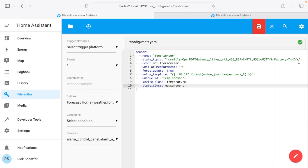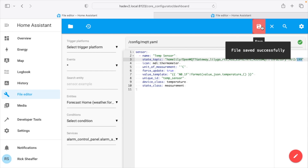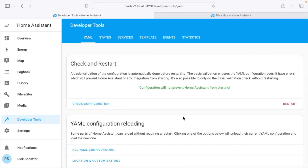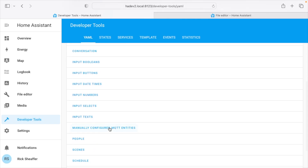This is a tricky thing — you might encounter other brands of temp sensors, because we're not only reading our sensor, we're reading any temp sensor this antenna picks up on the LilyGo device. This could be your neighbor's temp sensors, and it'll also pick up moisture sensors, security systems, and all sorts of things. I'm going to leave this at 199 and can change it later if the batteries die. I'll hit Save, go back to Developer Tools, and hit Check Configuration. Then I'll click Manually Configured MQTT Devices to reload.